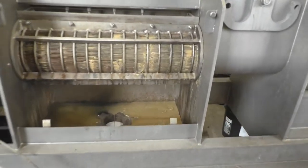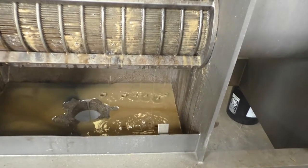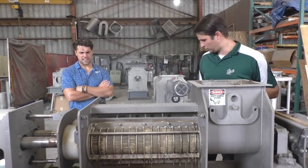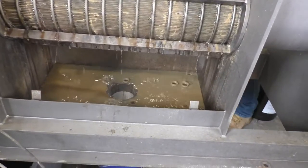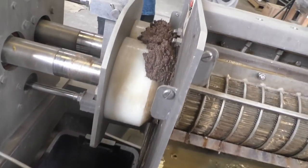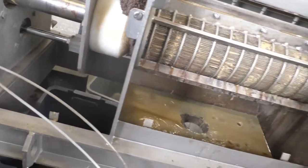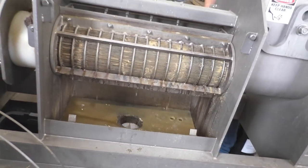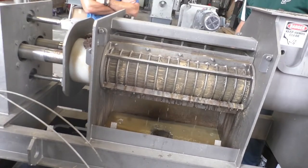I'm getting a little liquid again. We found a silver bullet — we're getting a steady stream of liquid and we can see cake coming out. I'll try 20 hertz to get a little more capacity, and then we'll start a timed test.